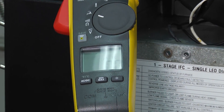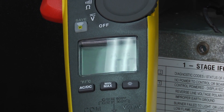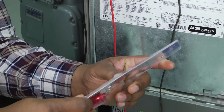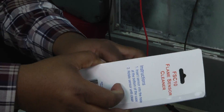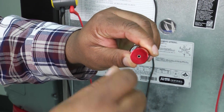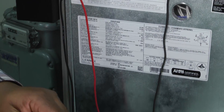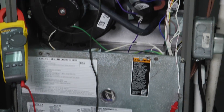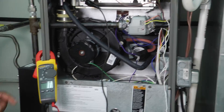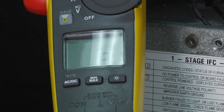As we go through our system we'll start up here shortly and get a reading. The packaging on this flame sensor cleaner is easy to get to — you open it up and on the bottom there's a little place where you stick the flame sensor in to clean it. Our fire is lit and we can see we get a reading on our meter from our flame sensor at 3.1 microamps.